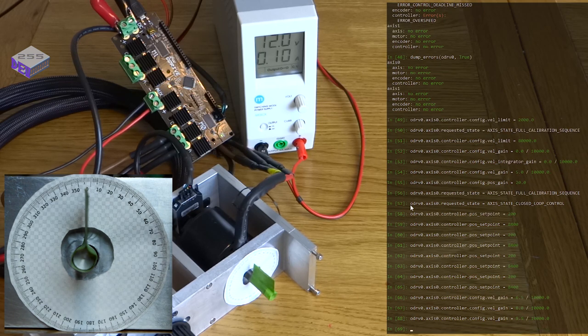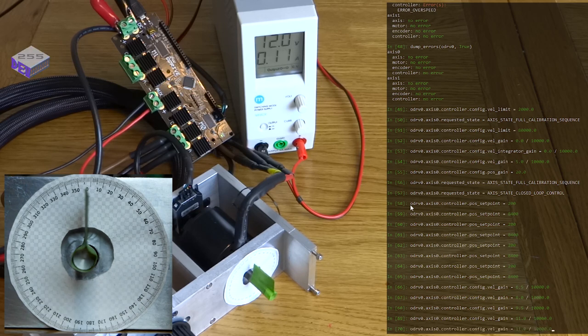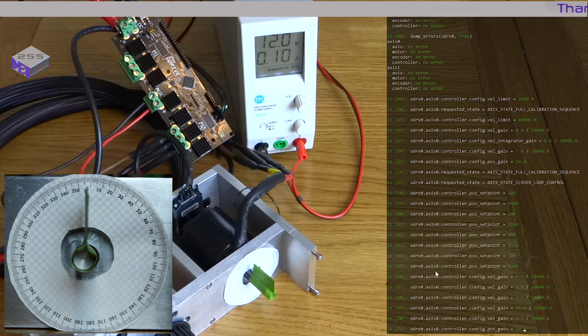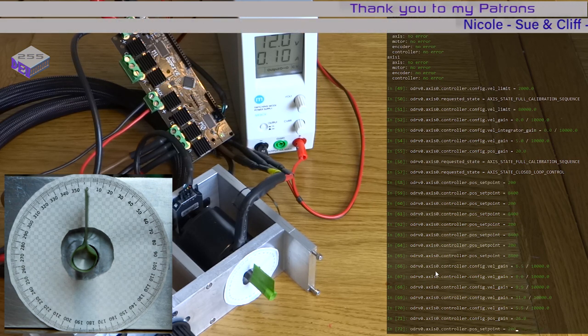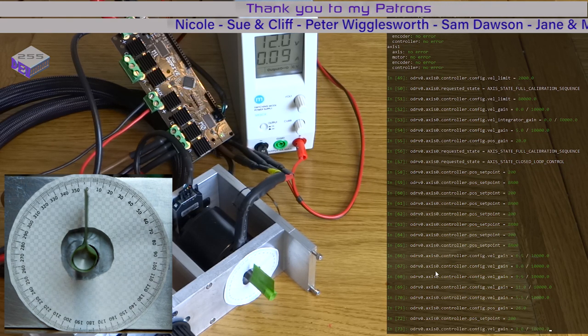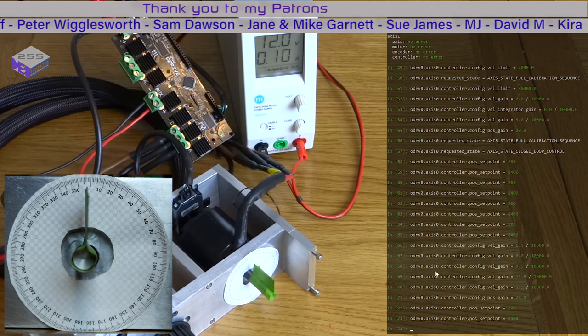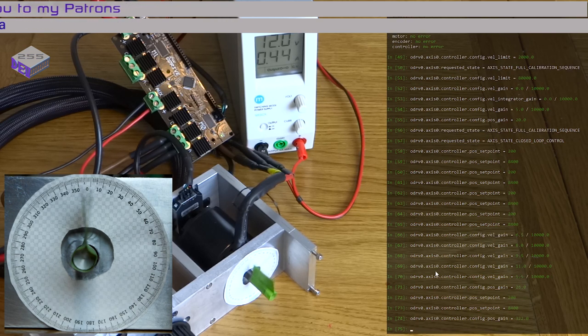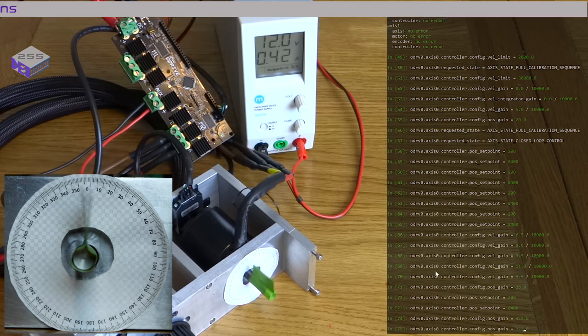As you can see, if you step up the velocity gain, the tape on the motor is twitching backwards and forwards, to the point where 11 makes it vibrate quite a lot. So I'll just step that back to 5.5, so half of that value as it says in the guide. Definitely don't set it to 322. That's better.